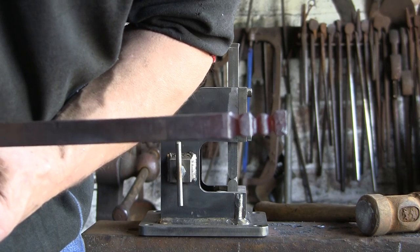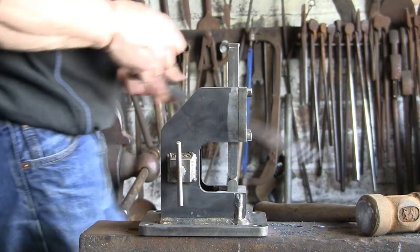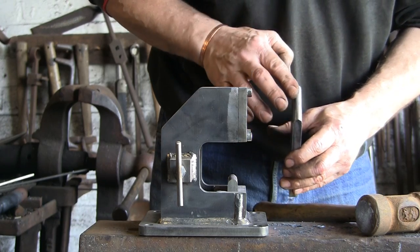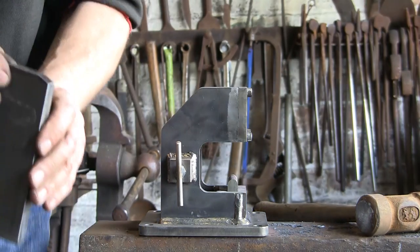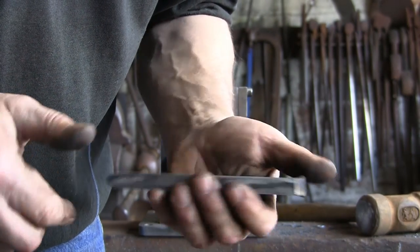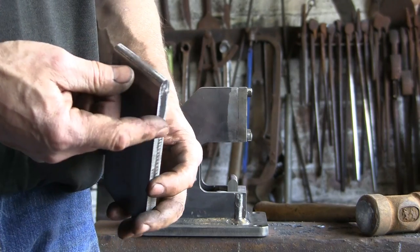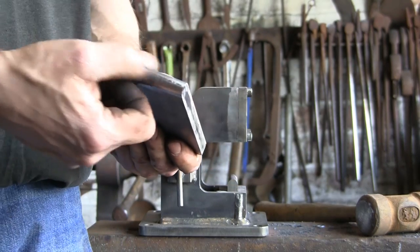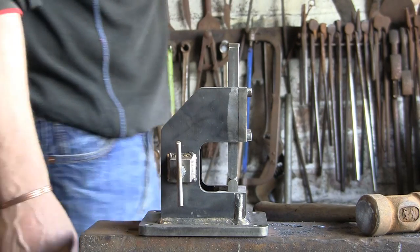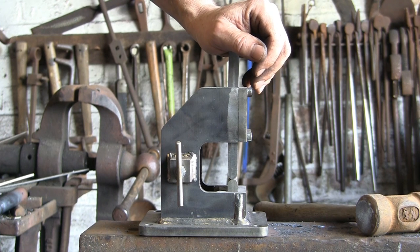Again that would have been better if it had been narrower, down to perhaps quarter inch. Now I'm learning what the tools do - that's what the whole job's about. The bottom tool I've used quite a lot and it's not left a mark on the working end, but the hit end you can see it's damaged quite a bit. It doesn't matter though - if you were doing millions of these you'd want to make it out of decent steel, but if you're just using it every so often it doesn't matter. You just grind it back and back until it's virtually down to nothing and it's cheap - a bit of tool steel is going to be expensive and hard to make into a die. So that's my lot - I'm going to go and walk the dog. Thanks for watching the conclusion of the guillotine tool.